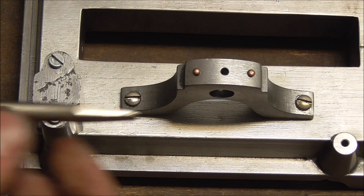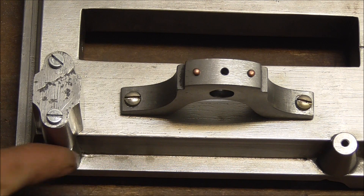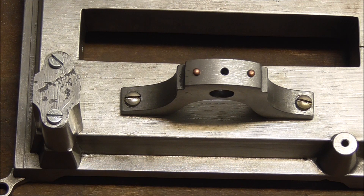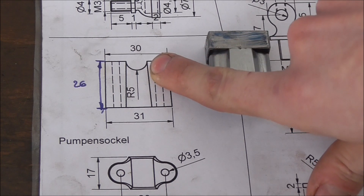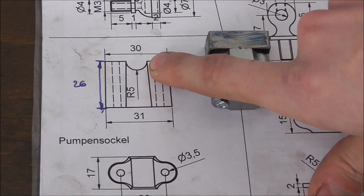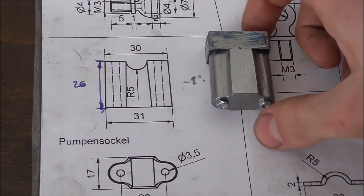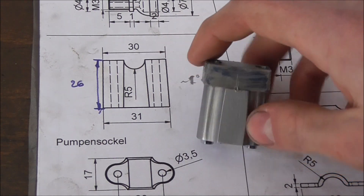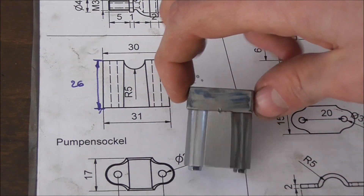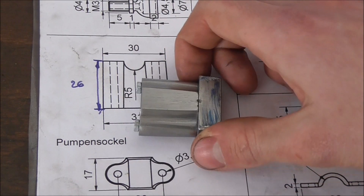And there we go. Now as you can see, there is no fouling anything and the contour matches up nicely. This half of a hole here would of course be a brilliant job for a 10 millimeter milling cutter, but I just checked — I still don't own a milling machine. So what I'm going to do is knock out a small piece of metal here and drill a hole right through the parting line between the two.